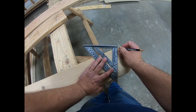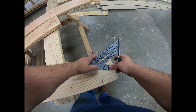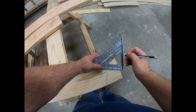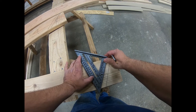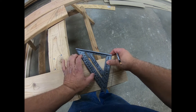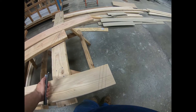I'm going to make sure that I'm on my 1 and 1/16th mark and draw a line. Then I'm going to take my speed square and draw two marks — one on each side of my line, 3/4 of an inch away from the line. Then take your speed square and line it up on your 8 and through your mark, and do both of them so that you have three parallel lines.